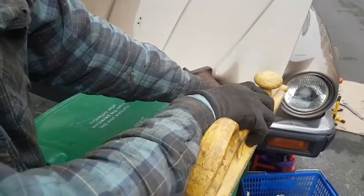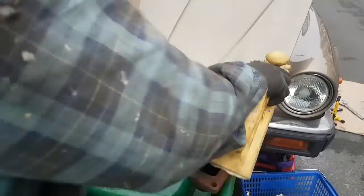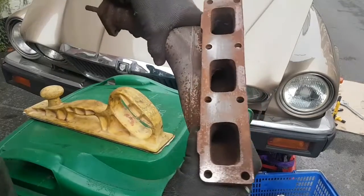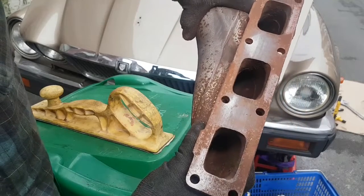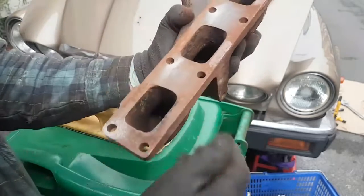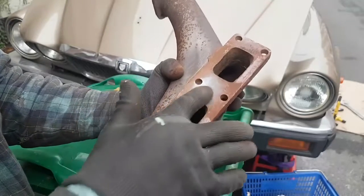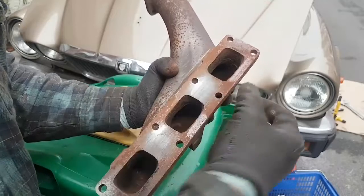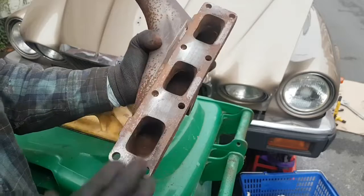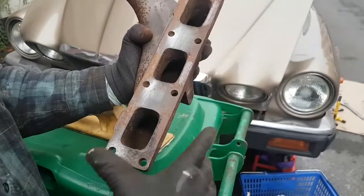I'm going to do it by hand, not with a machine. You can see it's starting to come good - all these dark areas are rusted low spots. It's actually quite low, so I'll have to keep rubbing and cut away some of the shiny areas and dig that down until we expose good metal. It might take me an hour of filing, but I am going to do it - I'm going to get a perfectly shiny smooth surface.